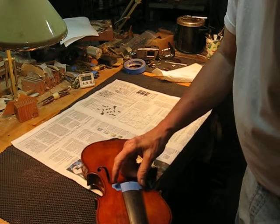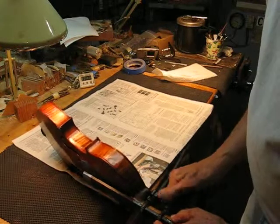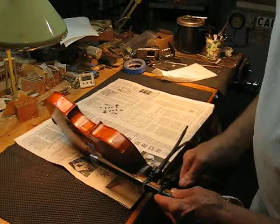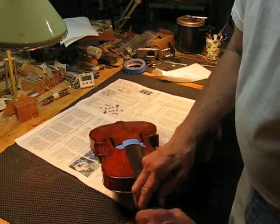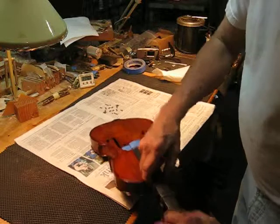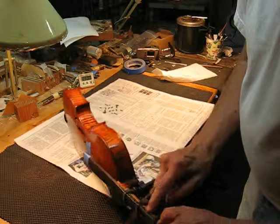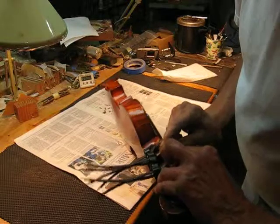We're going to check it and get closer. Then we're going to tighten the clamp in the middle here. There will be some glue that works out and gets under the clamps, but we'll just wash it off as it cures. I'll double check — even there. Actually it could go that way a little bit. It's awful close. And there's just a little bit of a ridge here and we can scrape that down. This side's pretty much even all the way across.